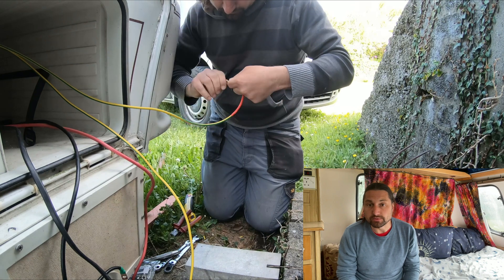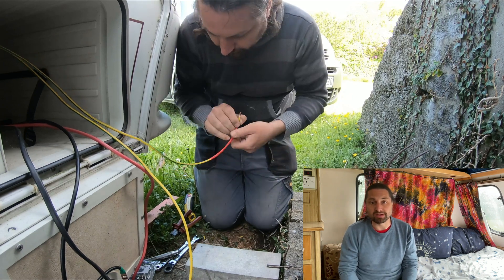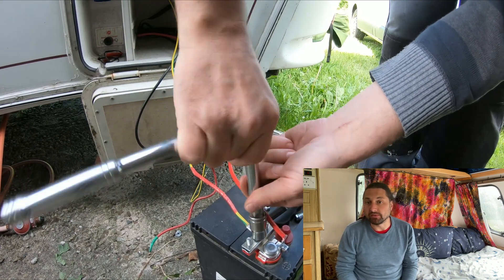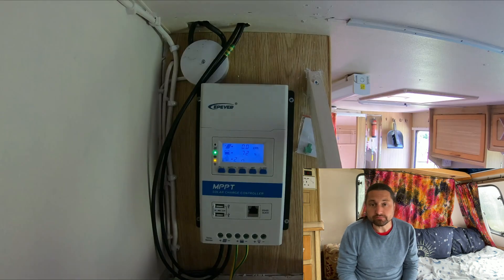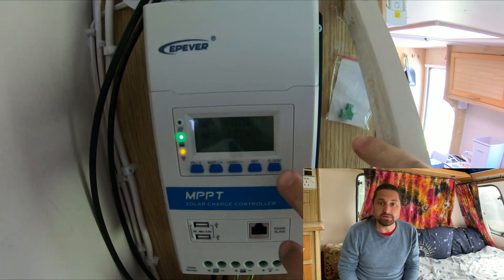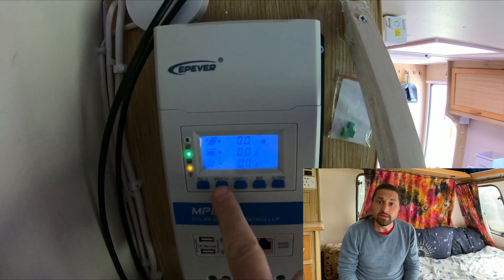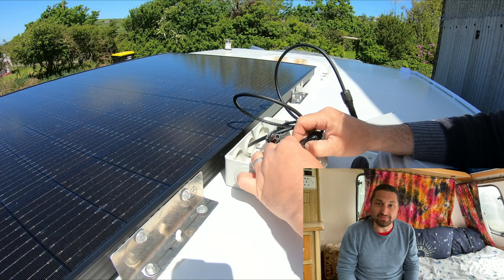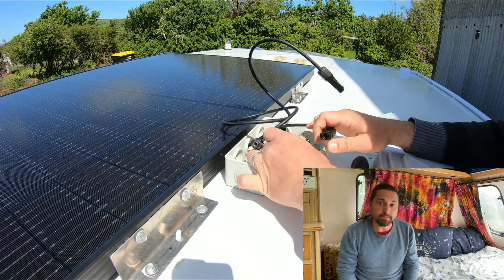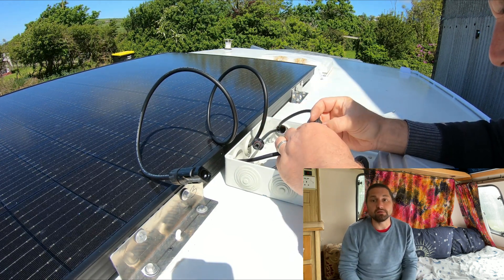I cut the cable so that it was long enough to touch the ground, which would always enable me to put the battery on the floor without pulling on the cabling. I replaced the original terminal connectors with new ones with three poles to connect to, making the wiring to the battery a lot neater. Back inside, power was now getting to the charge controller so I could make the connection from the panel. I'd advise checking the polarity using a multimeter before connecting the solar panel to the charge controller just to double check that you have them the right way around. The markings on the connector plugs on my panel featured a positive and negative symbol moulded into the plastic, but you will also see a red band around the stem of one of the plugs — on mine this was the positive. Don't trust anything; take your multimeter and check.